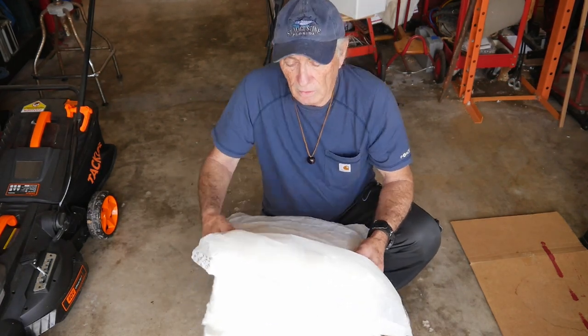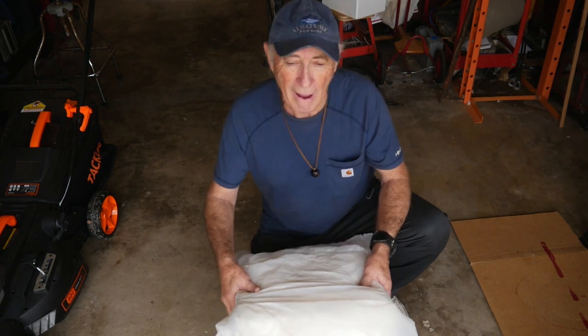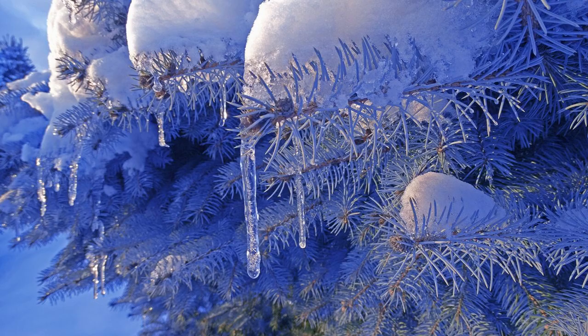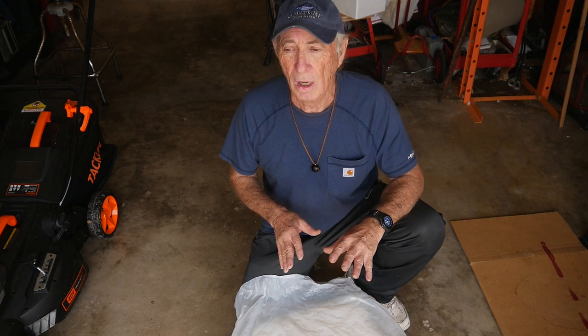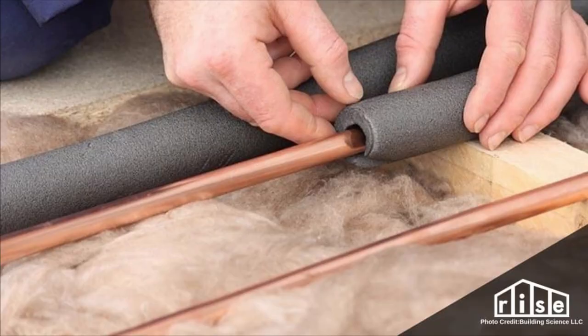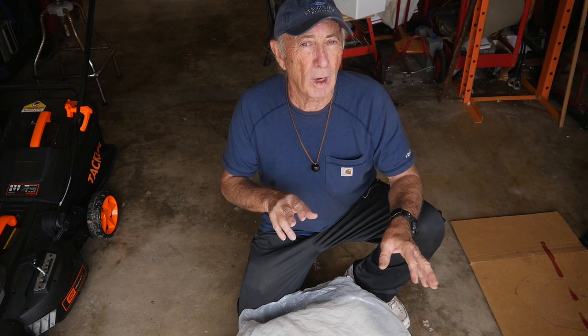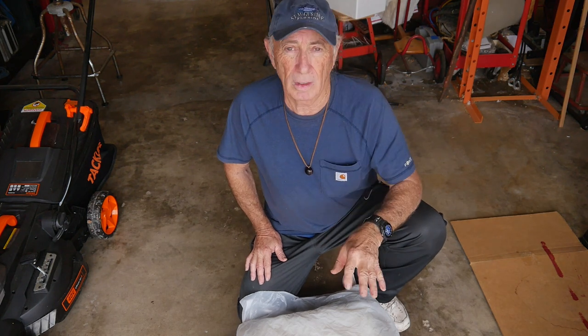That sealed the spigots so I wouldn't get cold penetration from outside during this really long cold snap. I'm in southeastern Texas - we shouldn't be getting that kind of weather, but it happened about 40 years ago too, and it can happen again. The other thing I did was insulate my hot water lines with black foam pipe wrap - I call them noodles. I bought about 100 feet and tracked down all my water lines up in the attic, insulating them and adding extra insulation on top.